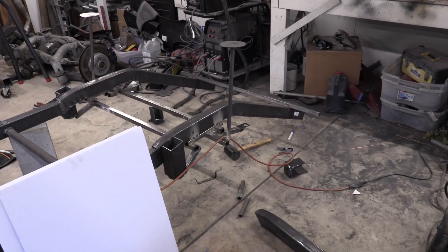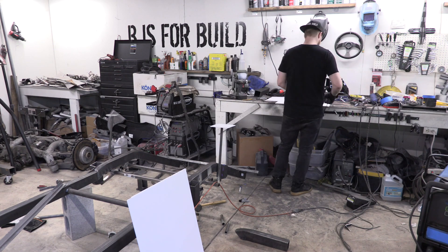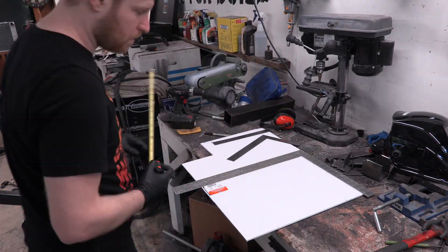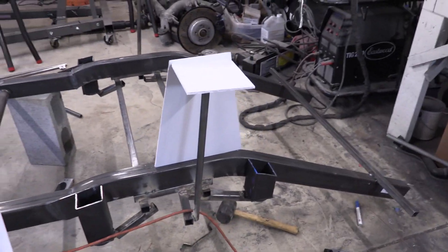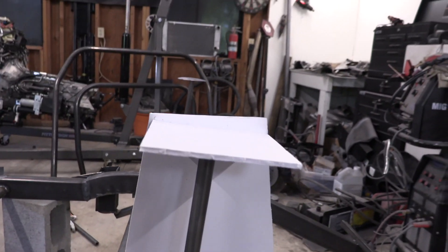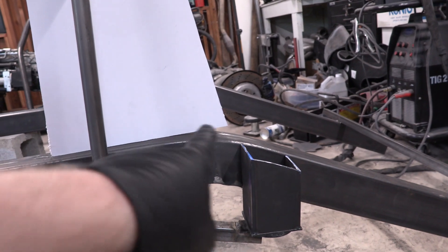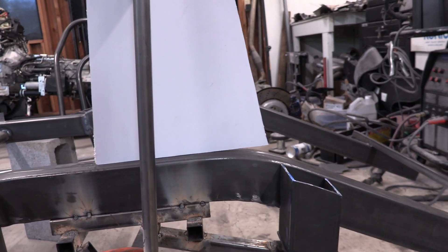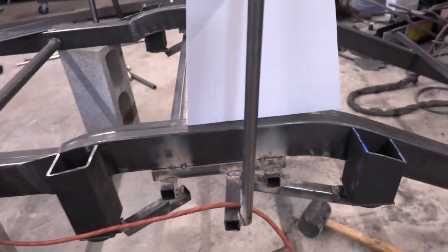That's some good quality arts and crafting right there. It's starting to take shape now. You can see we got this gap down here on the bottom - that will not stand - and a little mismatch on the top. The idea is I cut this thing extra tall so we could shave away the bottom until it flows right into that railing. We've got to take away a lot of that space on the flat, so I'll start by cutting a little bit and then hit it with the belt sander. That'll figure out the bottom, and then we'll make it match up with the top and we'll have our first two pieces to guide the placement of the rest.